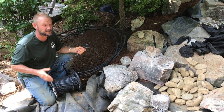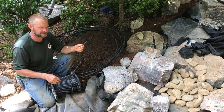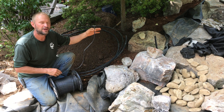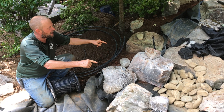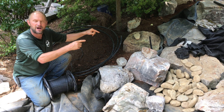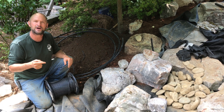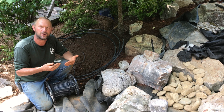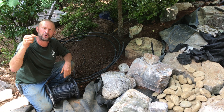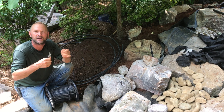When you finish the whole job, make yourself an after-job video. Don't gang lights together — one light, one connection. Walk around at the end of the job: 'Here is the light, the connection is next to that rock.' Go all the way around your water feature, shoot a video, and put it in your client file. When your team goes back out to replace a light, they watch a five-minute video, go straight to that connection, and they don't have to dig up wires or pull apart 15 different connections to figure out which light is out.